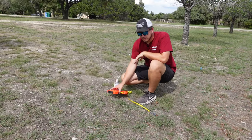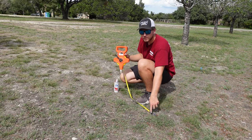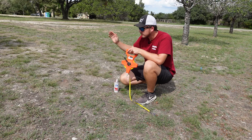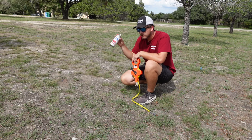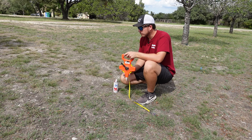The first thing I'm going to do is take this tape measure — I've already put it in the ground right here and this is going to be where the first piece of rebar goes for my first arch. I'm going to measure every five feet in a perfect straight line and then every five feet I'm going to mark with my spray paint, and that will be where each piece of rebar goes to hold each arch.